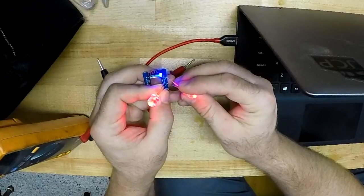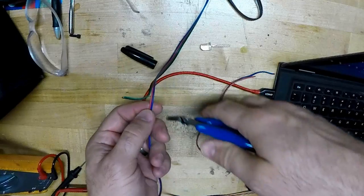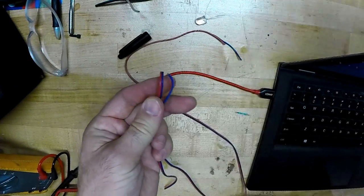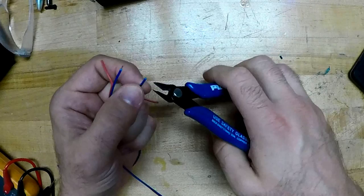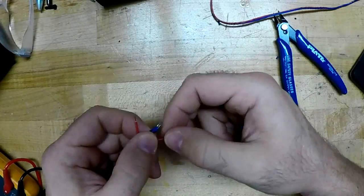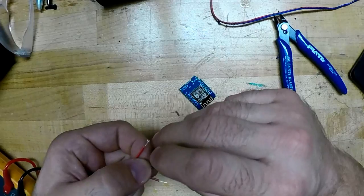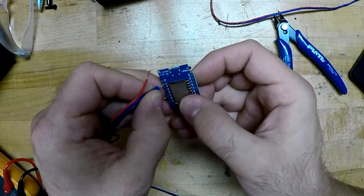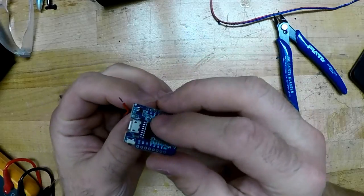First, I tested out my circuit, which consists of two 10mm LEDs hooked to separate outputs. Technically, you should use resistors here to produce the proper voltage, but I didn't bother. Wire came from a length of five connector cable that I had left over from another project. I twisted the cables together as needed, inserted them into the Wemos board, and soldered them with my TS-100 soldering iron.